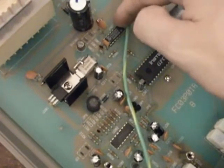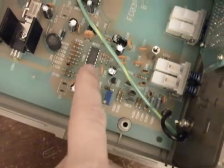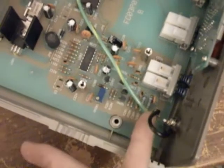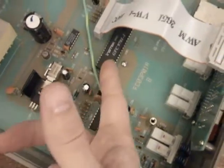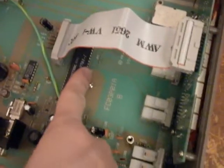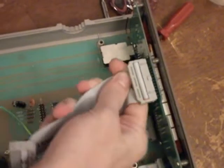We have a small — I think this is a NAND — like an inverting buffer chip. This is a small line driver. This is the input where the signal goes in. So we have some amplification here, and then a line driver which turns it into nice square waves with a very high input impedance, which means that whatever we hook up here doesn't really affect the circuit that much, but we're able to read it very strongly. After a little bit of wave shaping, the signal goes into the counter chip, and then the counter chip takes information from the switches — such as the period and frequency settings — and integrates that to determine what to display. The display is passed through this ribbon to the front.